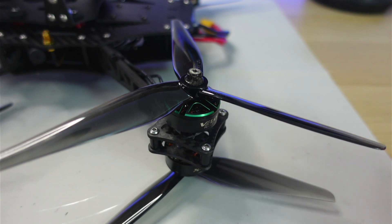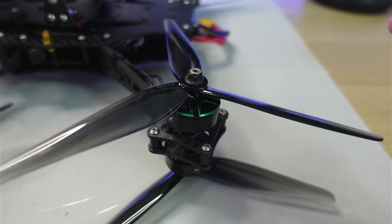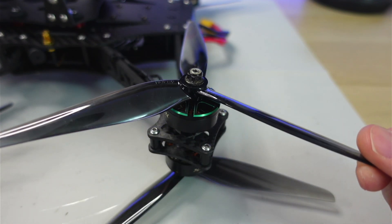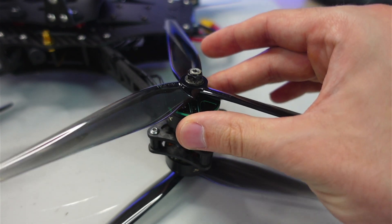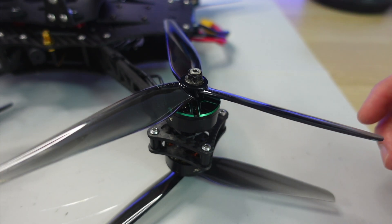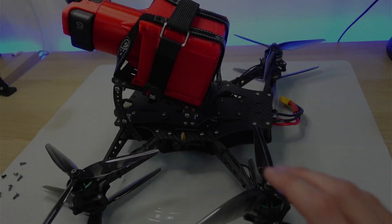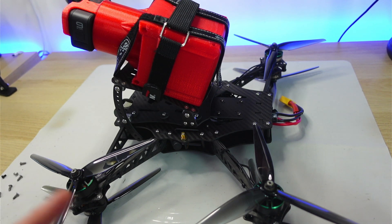For motors and props, I would recommend a 2808 sized motor with about 1300 kV, and something like an 8x3.7x3 or a 7x4x3 prop. The 2808 1300 kV motors are really well matched to a lighter-pitched 8 inch or a heavier 7 inch prop, and both options will carry a typical 1.5 kilo cinema camera payload very easily. If you're looking for 3D prints and landing gear for this frame, there are links to all of that in the video description.